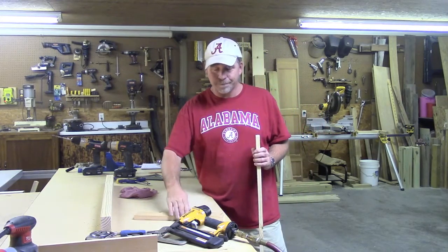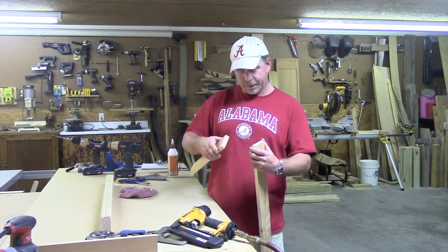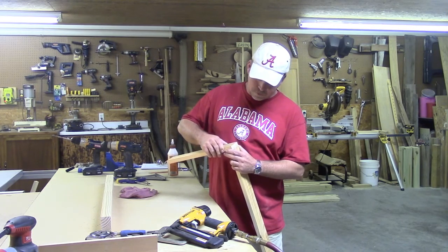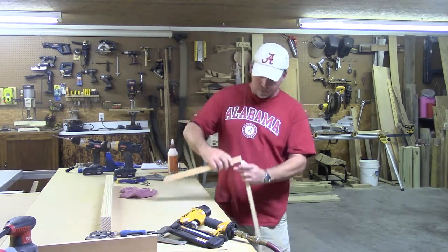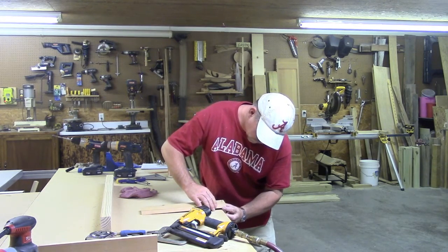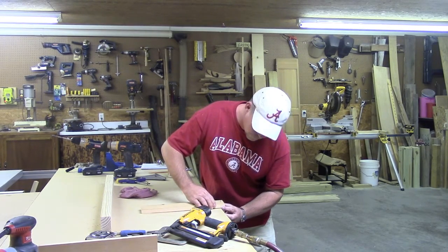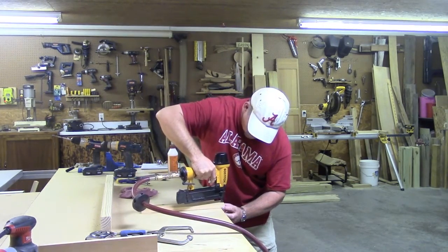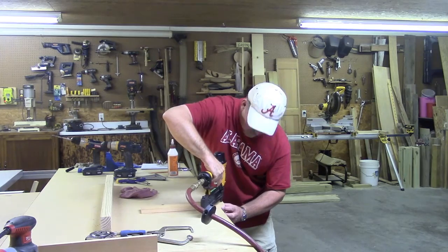And always remember, stuff didn't come apart because it had too much glue on it. But if you do this, this is going to be kind of awkward, so you need to make sure you don't place it where your screws are going in, so your screws won't hit that. Make sure everything is nice and flush, and go ahead and put a couple brads in there to hold the workpiece steady.